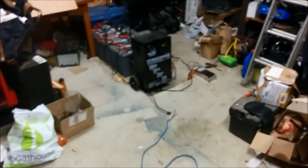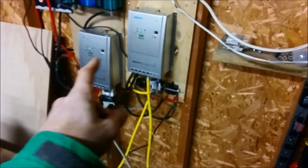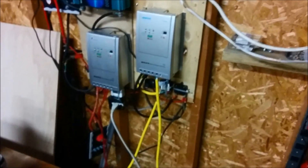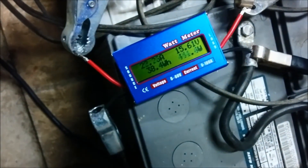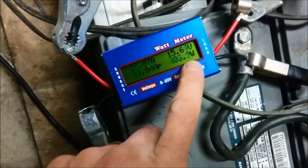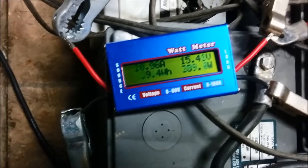There's my little comparison of my two generators. It looks like between the two, if I had both running at the same time, I could have about 80 amps pumping into the batteries — about the same as my solar here at 80 amps. Those two do go a little over 40 — I had 45 coming out of that one. I should probably take this off now. I think my batteries are pretty topped off. They're still taking quite a bit of power — might leave this for a bit. I'll turn it down to the 20-amp setting. A little bit healthier for them.